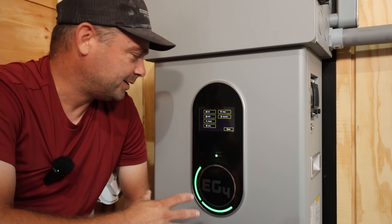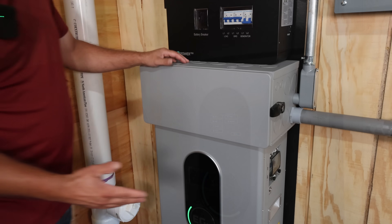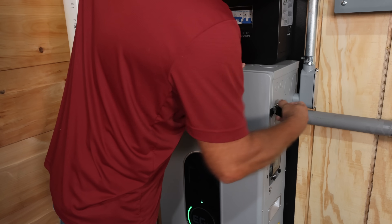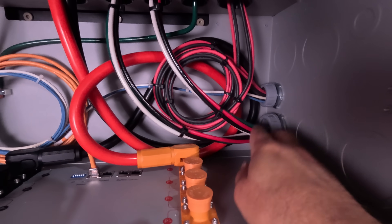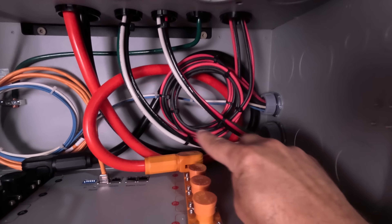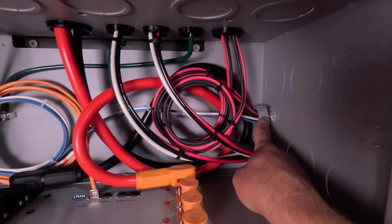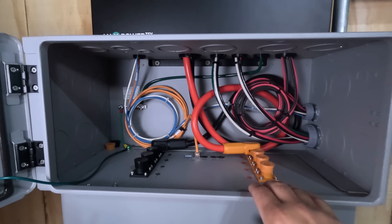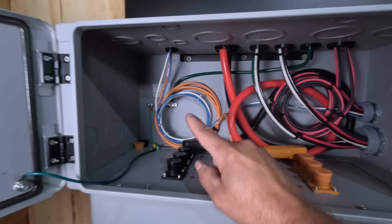As far as settings go, really the only thing you can change is the communication settings. Now that we're all wired up, let me show you the inside of the conduit box — it makes the whole installation easier and everything looks better. Inside the wiring trough you can see two conduits: one for AC power in from the grid and out from the inverter, and one for the two solar panel array wiring plus rapid shutdown coming up inside. We also added a ground bar in the back to give an extra grounding point and make sure everything is properly grounded.